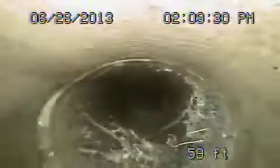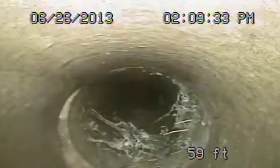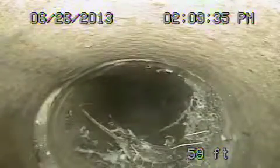We're coming onto the property. We're transitioning from 6-inch to 4-inch pipe — this is a 4-by-6 transition. You can see there are some minor roots at the 4-by-6. Now this is 4-inch clay. You see some minor roots there, also some minor roots coming in through the joint, and some minor roots here coming in through the coupling.